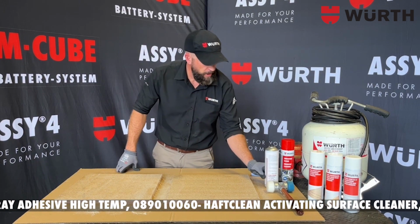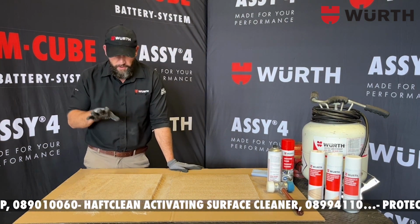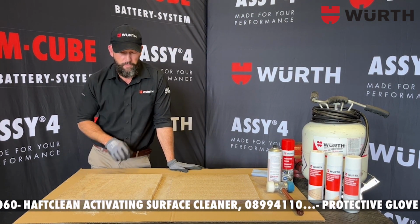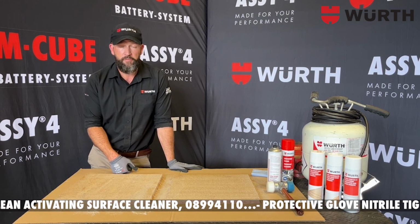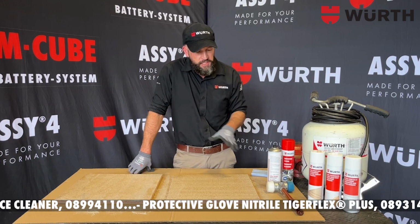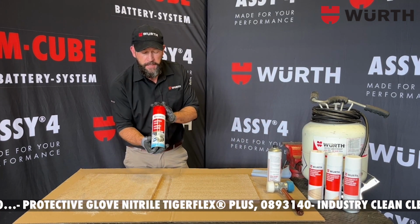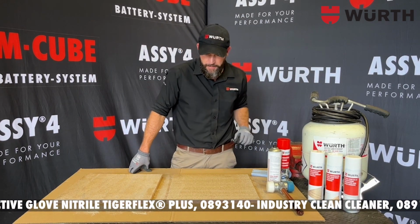So after I've applied my adhesive, I need to wait for approximately 3 to 5 minutes for the solvents or the propellant to flash off. 3 minutes in the summer, 5 minutes in the winter. Okay, now that we've waited for a 3-minute period, if you are slightly worried about a bit of overspray, we sell a fantastic product called Industry Cleaner, which will get rid of your overspray immediately.